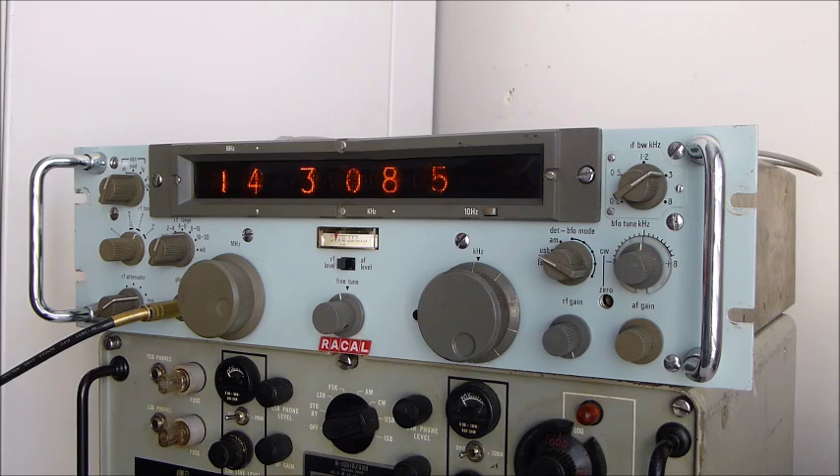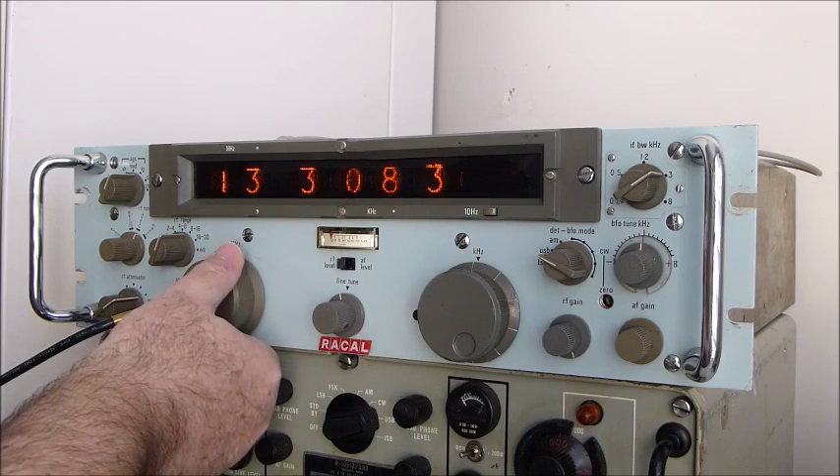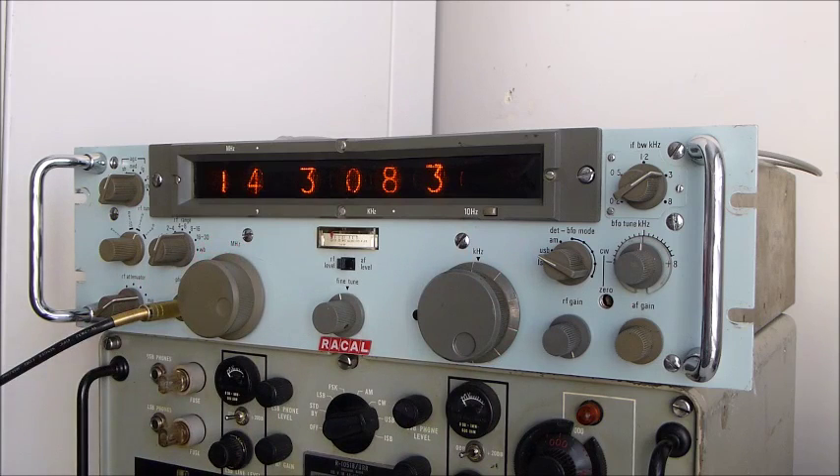It hardly drifts more than five to ten cycles, and it's not synthesized — it's a free-running VCO. This calls up just one megahertz decade steps, as you can see. So it's unusual, and I'm not quite sure why. I'd like to go in and find out why, but if I start opening up the VCO I'll probably damage whatever is inside the box that the other units have lost. So it's a bit of a conundrum. Most people agree it hasn't been regarded as a particularly stable receiver — however, this one, whether it's just serendipitous, is very, very stable indeed. I can leave it on this frequency, switch it off, come back a day later, and it's up within a couple of hertz of the setting.